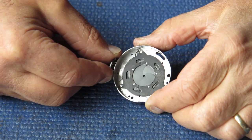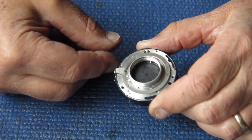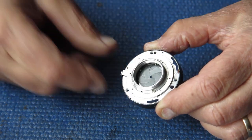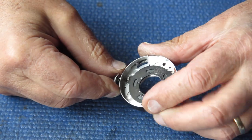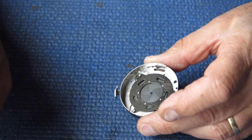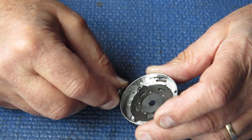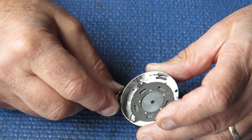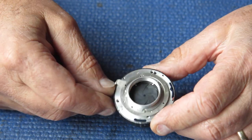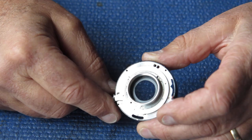Here's the diaphragm reassembled after proper cleaning. The action is much, much smoother - that moves very freely indeed compared with how it was moving earlier. I wouldn't say there was any obvious difference in the appearance of the blades - they're probably slightly cleaner than before I disassembled it, but it would be hard to pick that. There's still some obvious staining on that blade that didn't come away from the cleaning - that's probably long standing and would probably only remove with metal polish. I try to avoid polishing diaphragm blades because the rivets are easy to catch on the cleaning cloth, and if you tear a rivet off it's certainly a disaster. Even if you just distort the blade, it won't work smoothly.